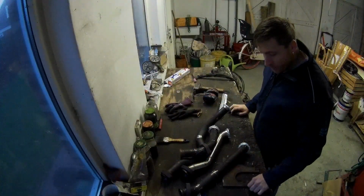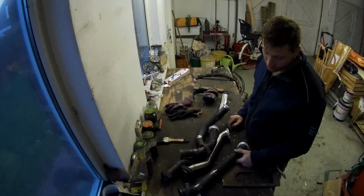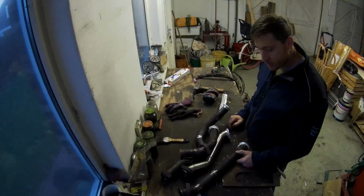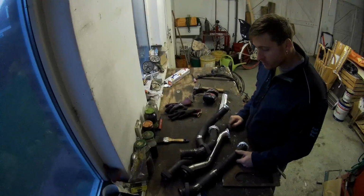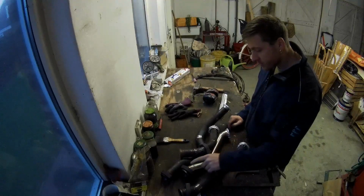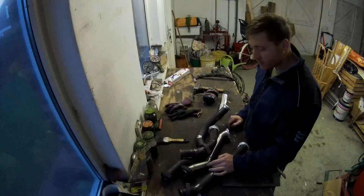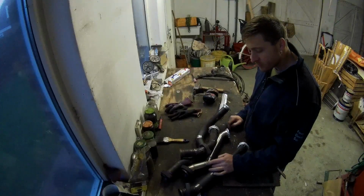So I got the four downpipes out of the car. So these are from the manifold to the collector next to the transmission. So these are coming down. I'm going to weld all the spots. Everything is going to be welded. Put it back in place and then put the center section in and have a look if it will fit. Otherwise I have to do some modification.